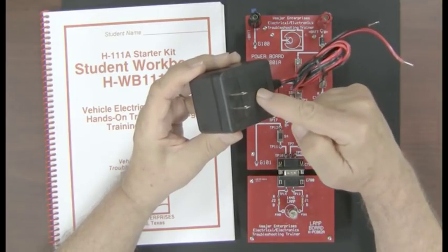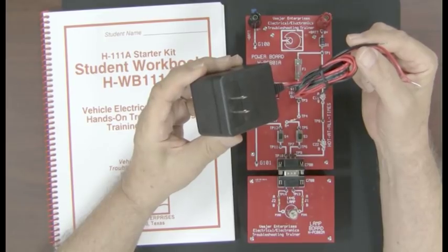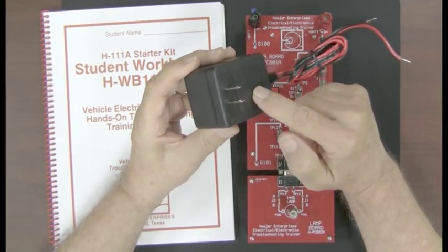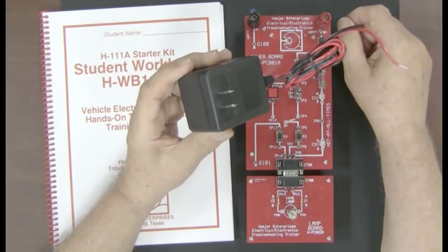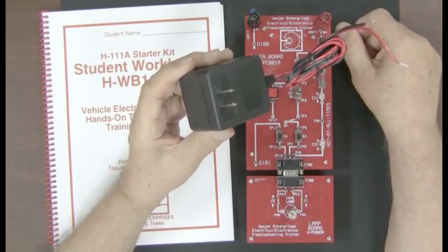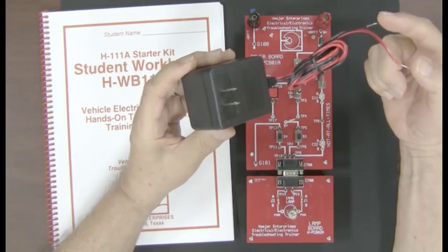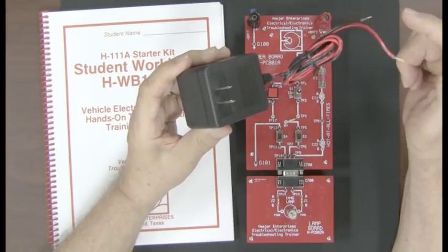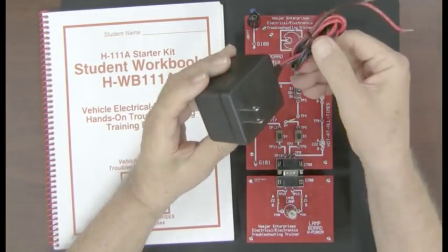The reason for the shorter wire is that if the power pack is plugged in, it's live — it has no on-off switch. So those two wires are hot, and if they touch while plugged in, it will blow the power pack. You might ask why not put a fuse in one of the wires — but basic electronics: the power pack will be destroyed before the fuse blows, and a tiny fuse that would blow faster means the circuit won't power up. By making one wire shorter, it's a reminder they cannot touch. Connect the red and black wires to the posts first, then plug in the power pack.